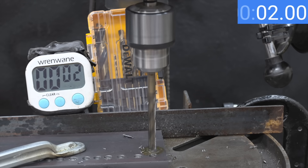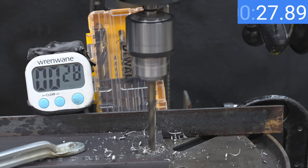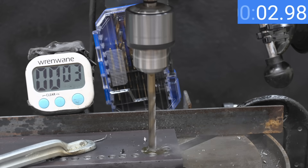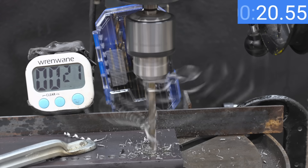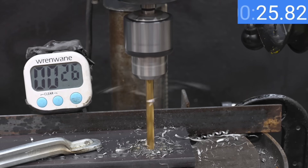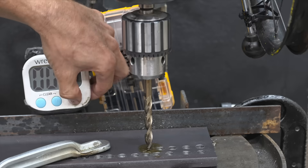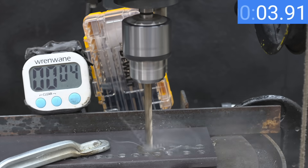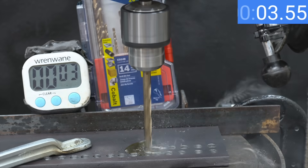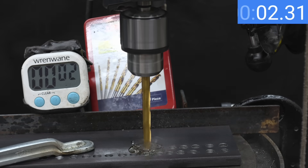Now let's drill through the same piece of mild steel used to establish the baseline, to measure performance loss. The DeWalt high-speed steel originally drilled through in 10.53 seconds, but spring steel caused a lot of wear — finishing in 37.81 seconds, a 72% performance loss. The Somata started slow at 15.84 seconds originally but held up much better than the DeWalt — 22.36 seconds is about a 29% performance loss. The Ryobi titanium wasn't able to drill through spring steel twice in a row, but was able to drill through the mild steel this time in 26.39 seconds. The Irwin Cobalt originally drilled through at 11.41 seconds and now takes the lead from the Somata at 14.45 seconds. The DeWalt Cobalt was a little faster than the Irwin on mild steel at 11.15 seconds originally, and is faster again in only 14.34 seconds. The Bosch tied the Irwin at 11.41 seconds in the first test and is a fraction of a second slower than the Irwin this time at 14.6 seconds — good enough for third place. The LW is still benefiting from the sharpening but experienced too much damage to compete, finishing in 17.86 seconds.